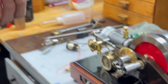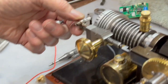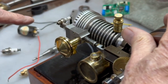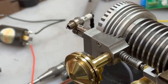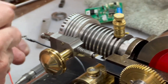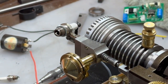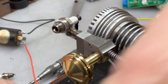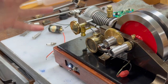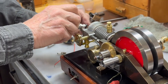I'm having trouble with the spark plug again. I've found that these spark plugs evidently have more resistance in them than a normal small spark plug. This is the quarter-inch spark plug — if I turn the ignition on and energize the points, you can hear that buzz and there's a spark in there. But if I put the CM6 spark plug on — the one used in this engine — it makes a different noise. What's happened is the spark is internal in the coil somewhere, and I can't see inside it. These plugs won't work, and I don't know why there's a difference.